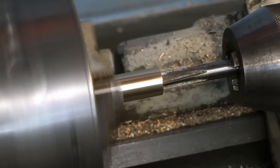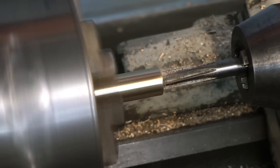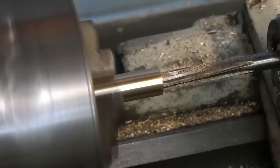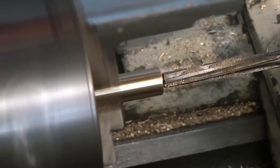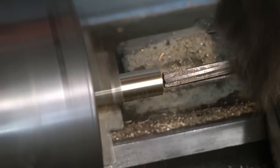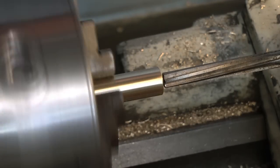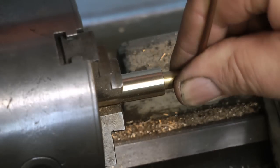It's a good idea to build up a collection of reamers. I work in imperial sizes usually, and reamers are used for axle boxes and bearing surfaces in general. I have most reamers from one eighth up to around one inch. If you do have to withdraw the reamer, use an old paintbrush to remove the swarf, then you can go through once again slowly. Once the reamed hole is complete, your component will fit very well.